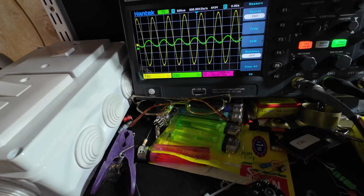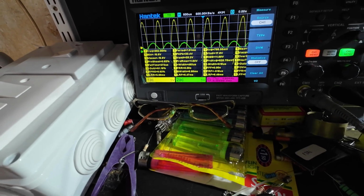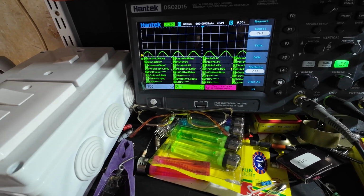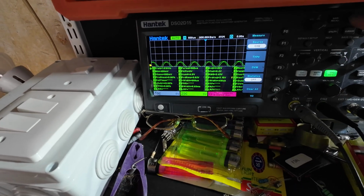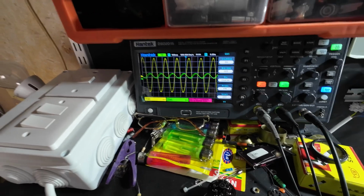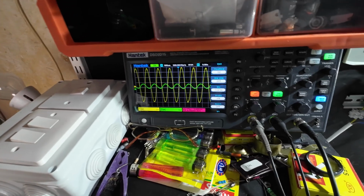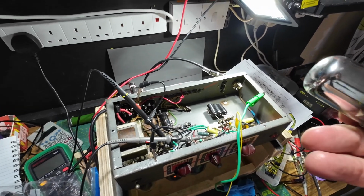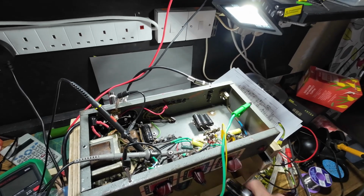But the peak to peak voltage, 34, that's peaking at there. Five volts. So massive problems there. But the 7N7 looks a much better tube. Now remember, we can't test these Loctals. Is this 7N7, 7F7, is there something wrong with it?